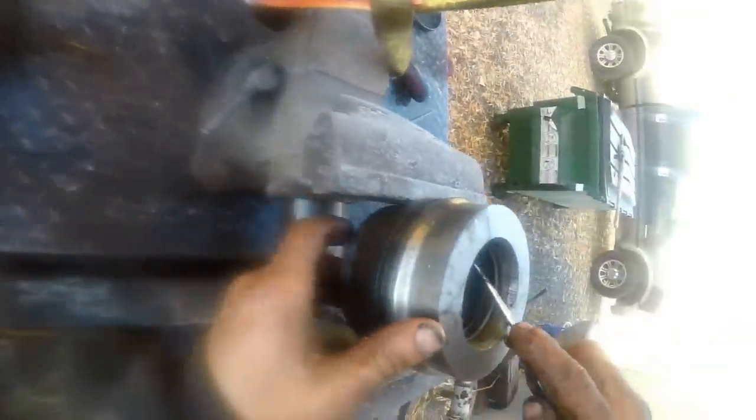This one, the rod seal's still in this one. It did come clear out of the head on the other one. I'm gonna clamp it here, but don't need to clamp it very tight on them threads. Just barely. Shouldn't take much. Okay. Should have kind of a double. Pick here. There's a backup ring below it.